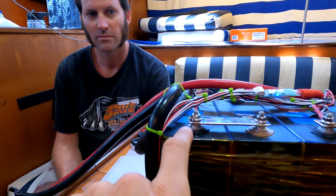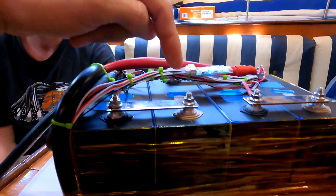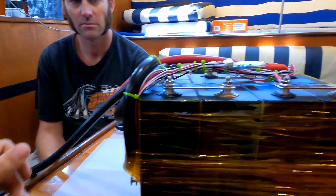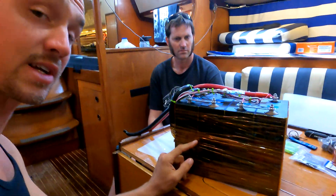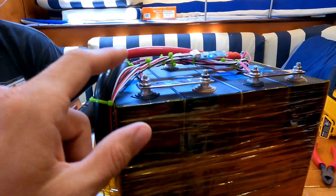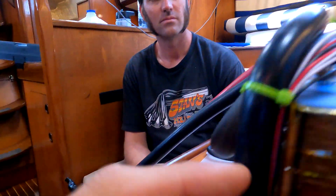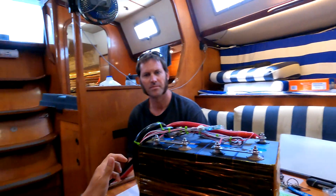So that's a compressed version of what I've been working with. To recap: we have four big cells, bus bars connecting them in series — negative to positive, positive to negative, negative to positive — and those two exposed ends become our live arky sparky terminals. This is called Kapton tape — a non-conductive tape that holds it all together and makes it look super cool. The battery management system has five wires: one to master positive, one to master negative, one to each cell positive, plus one to a Bluetooth module and a temperature sensor. When you break it down, it's actually really simple. Any questions, let me know in the comments and I'll give a very simplified answer. Cheers.